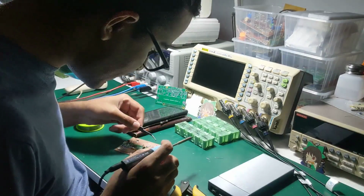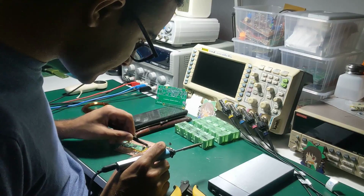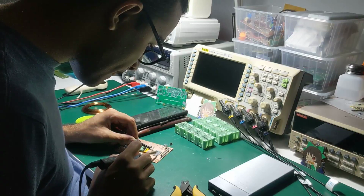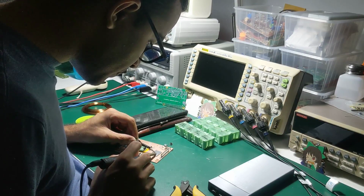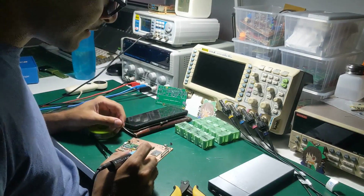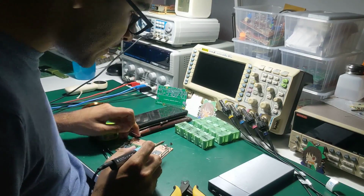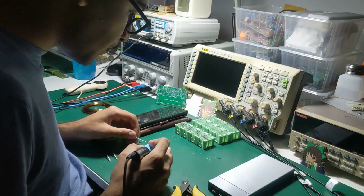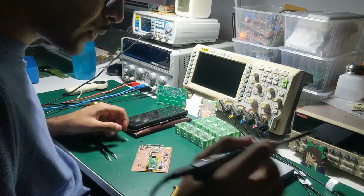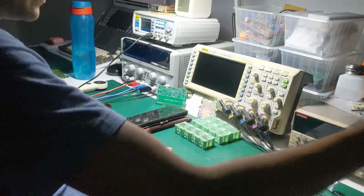A common collector amplifier with a pull-up. It works like a CMOS, it cannot have indeterminate voltage. Only rail to rail. It's literally CMOS made of BJTs. I'm not talking about rail to rail, I'm talking about the drive strength of a pull-up versus an open collector. Do you know how much current the TL494 can have on its output? 200 milliamps. Exactly, on your generator. It can sink 200 milliamps, but you're sourcing like 15 into the base.